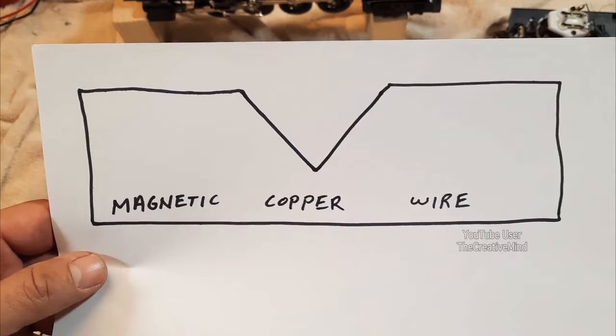Now let's do a green-to-red megger test. We're going to take the red clip, put it on one wire, the black on the other, and push the button — whoa, I never saw that before and I think I have a theory. The double field winding is just two wires wrapped around each other in a plastic insulator. The reversing unit sends current through one field in a clockwise rotation to make the armature spin clockwise, and when it switches over it sends current through the second field in a counterclockwise rotation causing the armature to spin counterclockwise.